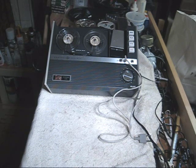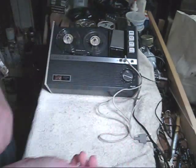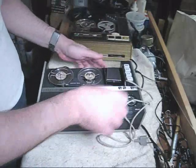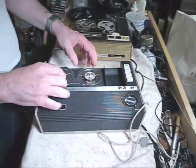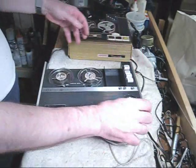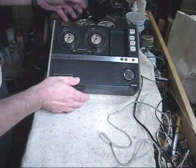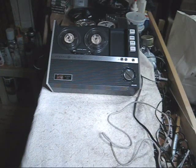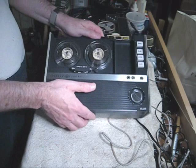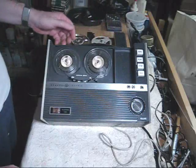Playing with the capacitors — there's only three of them in the circuit — didn't make any difference to the quality of the sound. It does make a good playback of a pre-recorded tape, and it does have fairly low wow and flutter, which I will show you in just a second. So we're going to listen to it play back.